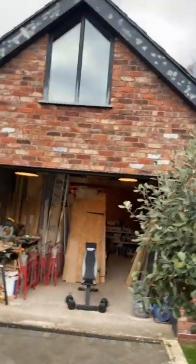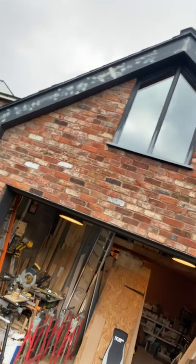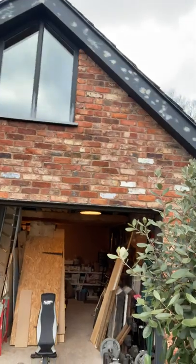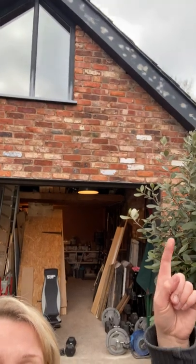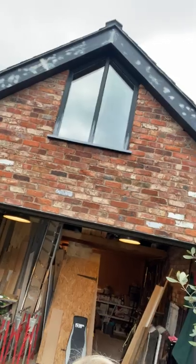So we shall take the phone off the arm and go on a little wander. You can see the house in the background - this is the garage area. We've used a redwood board at the front of the garage on the apex and you can see that it's got measles. The reason it's got measles is that when we put the redwood up, we painted it with a really good quality primer and undercoat onto the bare wood and then a really good quality top coat - and what happened? All the knots have popped.